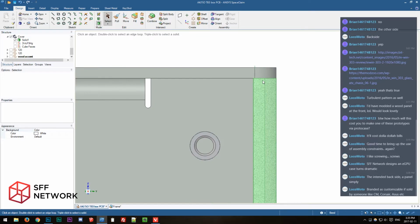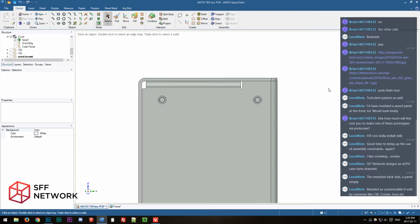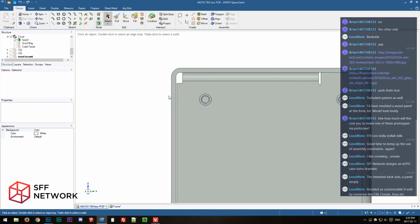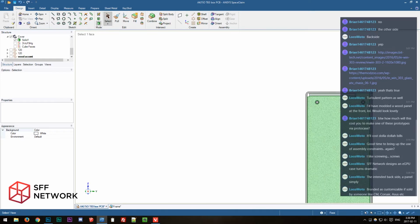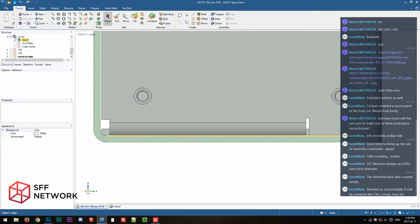But that doesn't really work in reality, because when you're designing sheet metal parts, or actually just any metal parts in CAD, the CAD model should only be of the bare metal, or if there's a coating that's part of the metal, like if it's galvanized, I think you can include that too. But if it's a coating added in a later process, like paint, then you don't include it in the model. It's just the metal. So you have to account for that though. And I'll just have to do this later. I'll need to figure out what it needs to be.